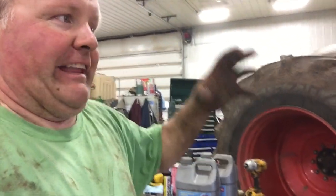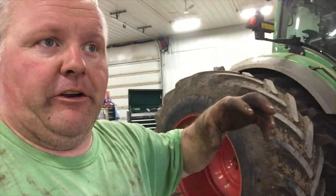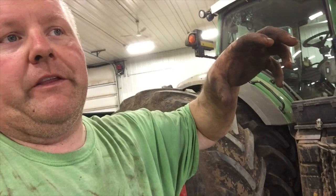Back to that torquing of those big nuts, it's 250 Newton meters and then backing it off 15 degrees. But when you read through there, you kind of got to tighten it up. They want half a millimeter end play on that shaft. So don't just back that off 15 degrees and that's set. You kind of got to work with it.